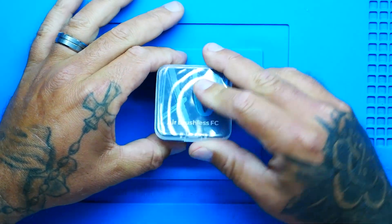This flight controller by BetaFPV has packed so much into such a tiny board. This board is 3.6 grams — it weighs nothing. We're going to go over it, then we're going to stick it in a whoop and show you how it does. Something you may want to know is that this is the first flight controller ever with the G4 MCU. It's a 1S brushless flight controller, and the G4 MCU is nearly double the CPU speed of an F411, which is what we're used to with all of our little guys.